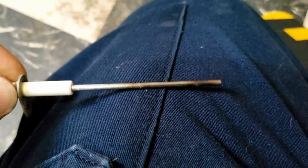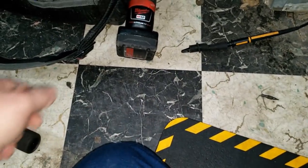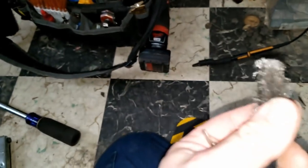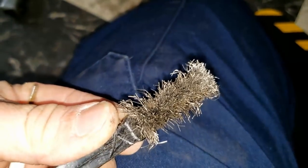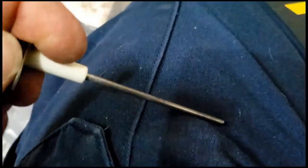Lennox has always been good about not damaging the metal because it gets too hot, like some brands out there. It really does not look that dirty. We're going to go ahead and clean it up with my stainless steel brush. Stainless steel doesn't scratch anything up — like I've said a million times, you can run that thing right on your skin and it doesn't hurt your skin, so it's not going to hurt the metal. There we've got it all cleaned up, no grooves in the metal, nothing's grooved up.